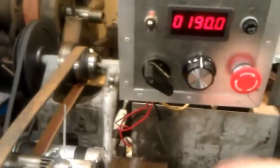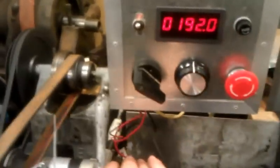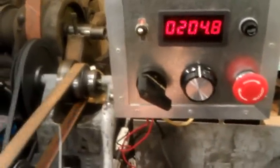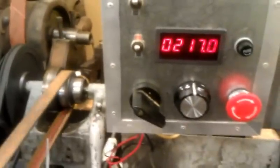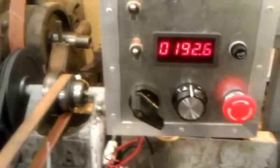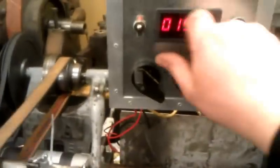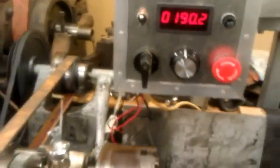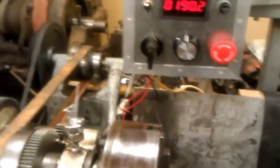The IR compensation is quite strange. You put a load on it and it drops and then it lifts back up. And then when you take the load off, it sort of over-revs and then settles back down — searches around for its speed again. Overall I'm happy. It's certainly got more power than the half horsepower AC motor it had, that's for sure.